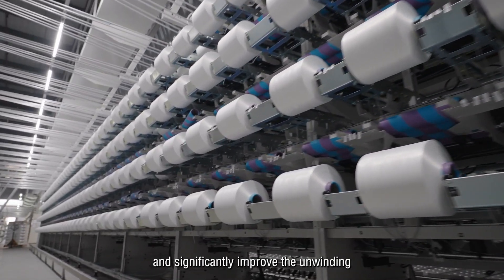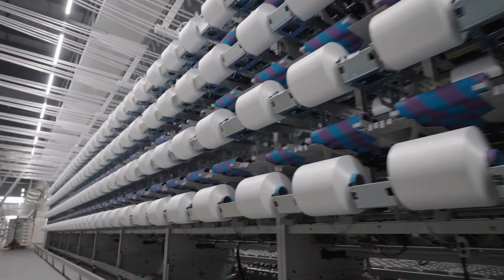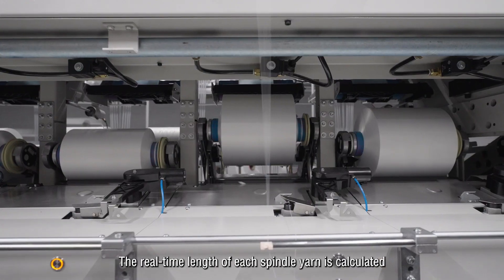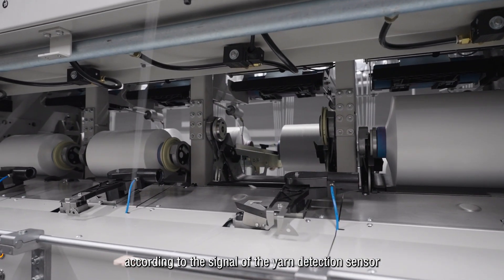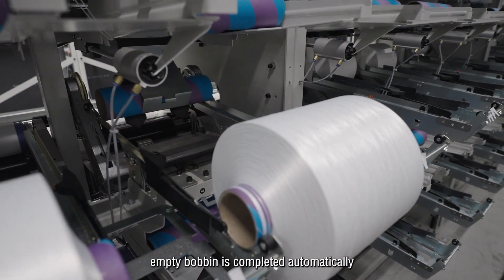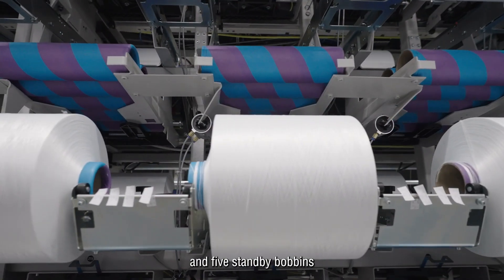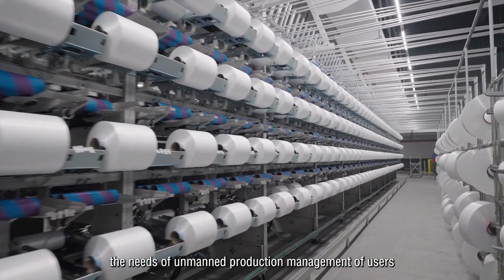These features improve the unwinding speed and significantly improve unwinding, dyeing, and weaving quality. The biggest advantage of single spindle drive is less noise. The precision winding model also has automatic winding function. The real-time length of each spindle yarn is calculated according to the signal of the yarn detection center. After reaching the fixed length of the full bobbin, the switching between full bobbin and empty bobbin is completed automatically. Each spindle is provided with two spindle storage areas and five standby bobbins, offering a high degree of intelligence to meet end-production management needs.